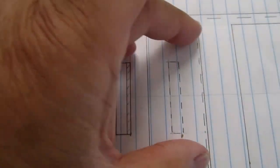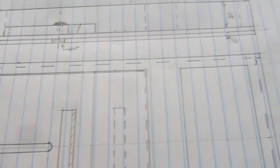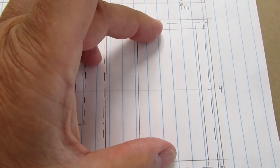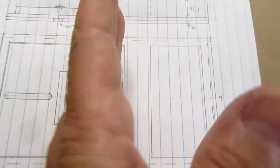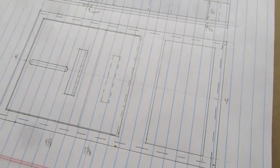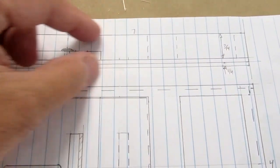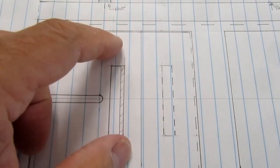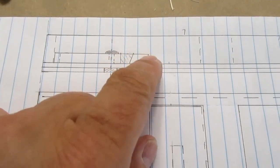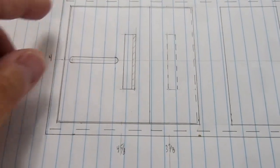And this will allow this whole block to move this way, and that allows a change of angle of the meter. And then there's the cutout here that the base of the cradle of the meter will sit into, and it's just the right width, and the depth doesn't change that much depending on a few degrees of meter tilt, so it should sit in there pretty well. It shouldn't skate out of it because there's a 3/4 inch wall around it. And if I find out empirically that this needs to be taller, I can always add on some little pieces right around here to make a deeper channel for the kickstand of the meter. But then let's see.